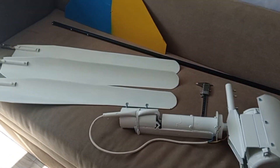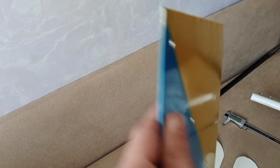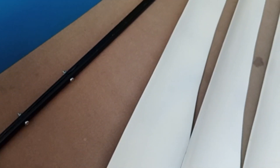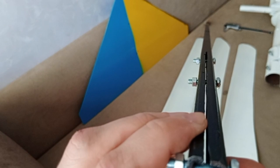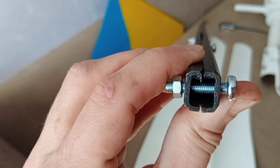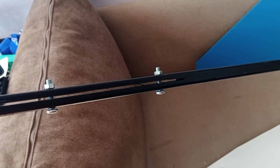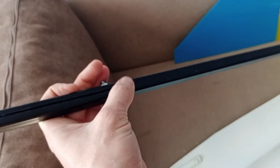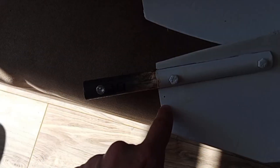That's how it looks — very interesting. Let's go through it one by one. First, the tail: this is an aluminum plate, quite thick, I believe one millimeter. There is a cut on the tail plate, and that's the only thing I don't like. That's not a good thing to do — I will weld it together and leave it as a whole, because cuts in two pieces will cause trouble over time and the tail may fall off. That's not safe, so I will redo that immediately.